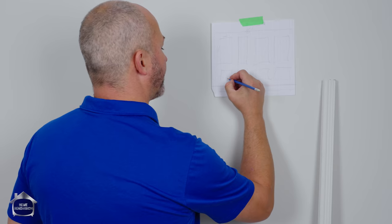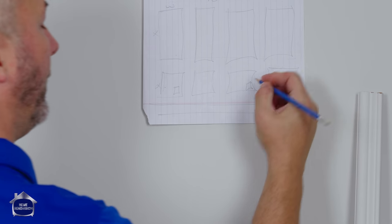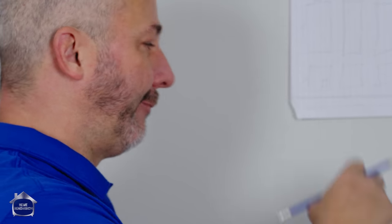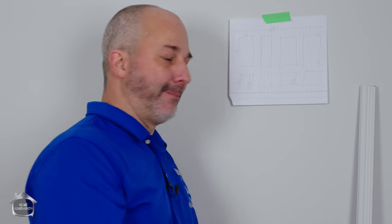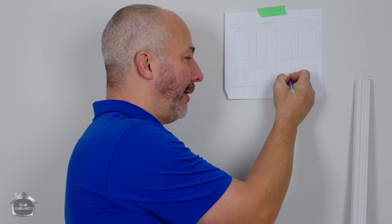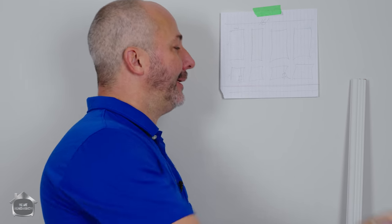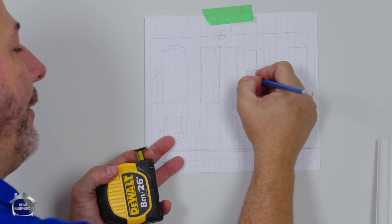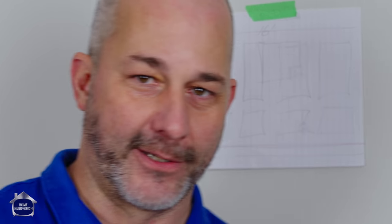Other considerations: we have two wall plugs, one on each side. We set this up so the wall plugs are high enough off the ground that with six-inch gaps, the trim will pass underneath. This is the trick with the math — you might need to adjust your gaps so trims aren't coming down onto the wall plug. In a bedroom it's not a big deal if you have to — you can have end tables or a basket to hide it.